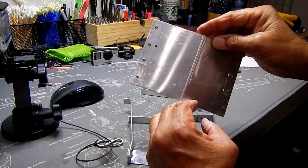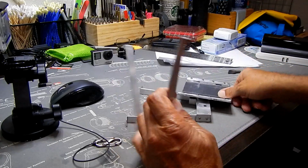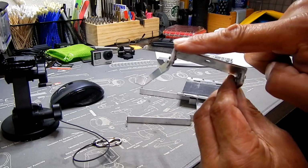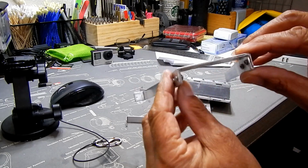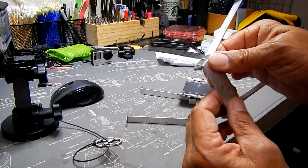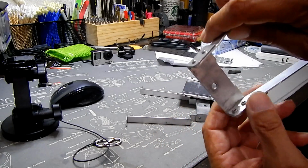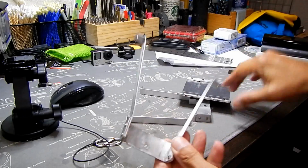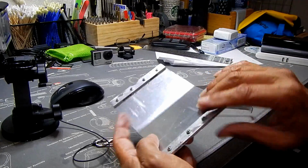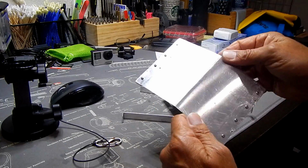And once it's all painted, it'd be hard for you to see how it was actually put together. And this piece here, I actually bent 2 of these, one a little smaller, and then I glued them together and made this laminated, so it had a little bit more strength than just one thin piece. All these were epoxied together, and then I screwed it. These joints actually failed while I was drilling the hole, but the screws are more than enough to keep it together.